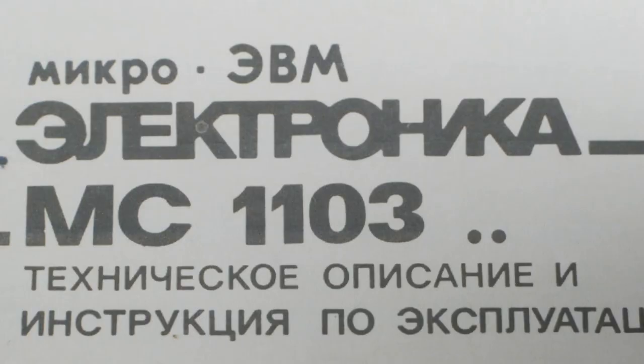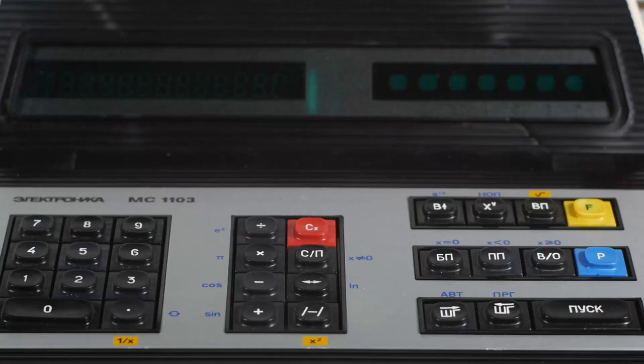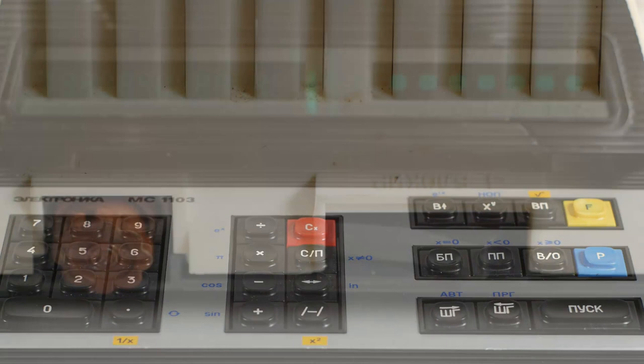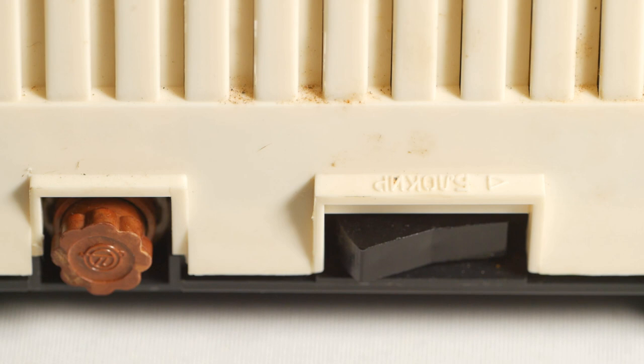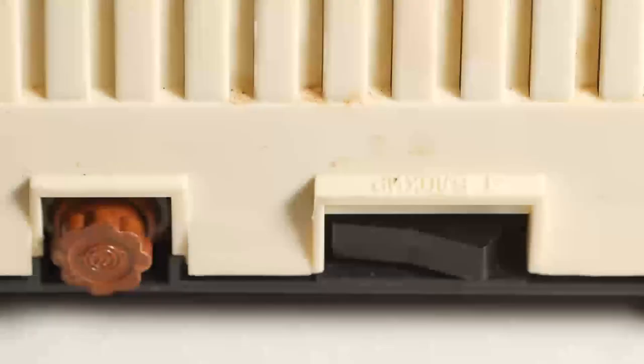Obviously I can use Google Translate on my phone, but it's slow going, and when it comes to the circuit diagrams they're handwritten, so Google Translate doesn't work very well — and they're kind of alien-looking compared to what I'm used to. Turning the machine on just makes one or two of the blobs on the right-hand display glow, and nothing else. As far as I can tell, there should also be a zero on the main display. The keyboard does nothing, with the exception of the start key, which makes the blobs go out. There is a switch on the rear marked 'blocker,' which disables the entire keyboard apart from the start key, to stop you inadvertently entering data when taking readings from external devices. But the calculator behaves in the same way no matter what position the blocker switch is in.